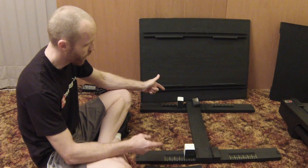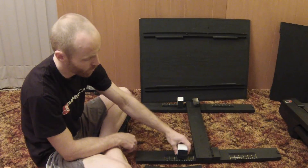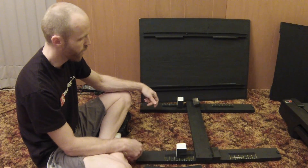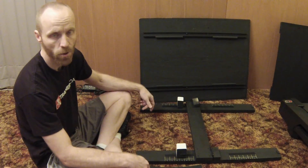Attach velcro to the bottom of each spring block. Make sure you match up your different sizes — a large one for the front, one for the rear. The markings on the base let you track positioning. The further the spring is from the pivot, the stiffer the feel; closer to center means less resistance. Make a couple of different sizes and experiment — it's trial and error to find the spring size and positioning that gives you the centering force you want.